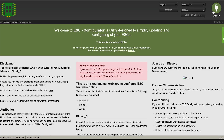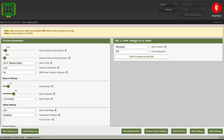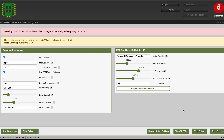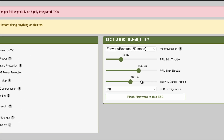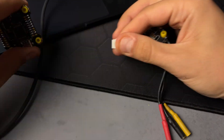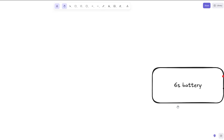Then it needed to be properly flashed. Most FPV flight controllers use D-Shot to communicate with the ESC, but for an ESP that's a tricky challenge — possible, but really hard to implement. The simpler way is to flash the ESC in 3D mode and control it using a PWM signal. Unfortunately, I didn't find how to do it without Betaflight pass-through, so you need to have an FC in order to flash the speed controller.